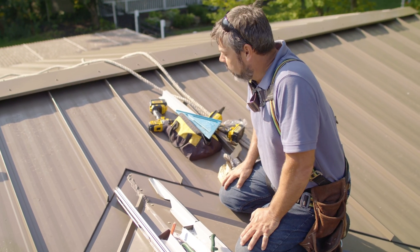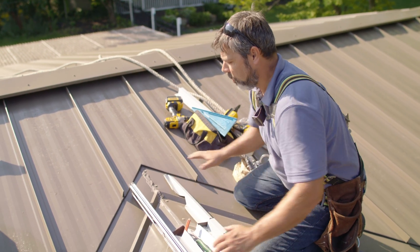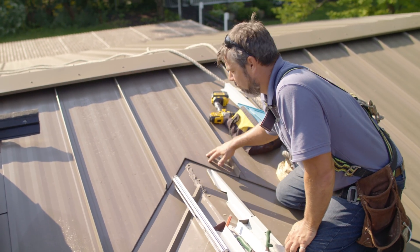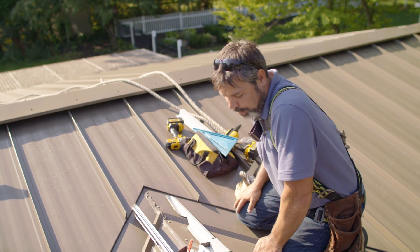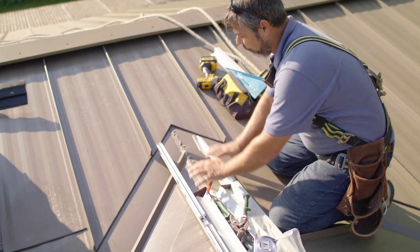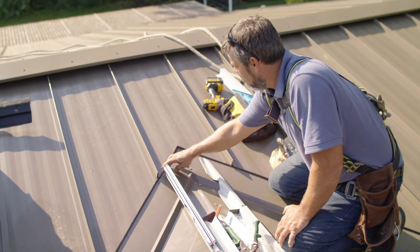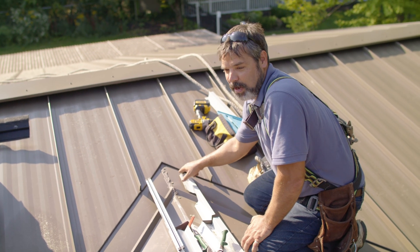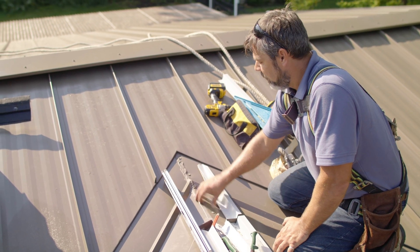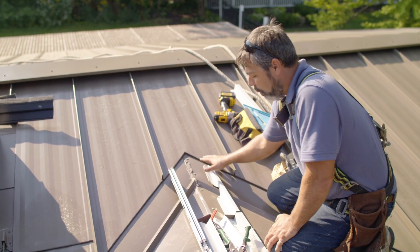This valley is like a big dormer coming into this roof. Very often you'd want to do your dormers first, because we can tie our dormers in, run up our valley, and then adjust our sheet length, or come up with our sheets a little bit to accommodate our cap. We're going to run a cap flashing across here and up underneath these sheets. That way this is all closed in — using the belt and suspenders method. We've done a good job making sure we're sealed in here, everything's been back caulked, everything's ice and water shielded, and now we're going to run our cap up under here so water is deflected once again.